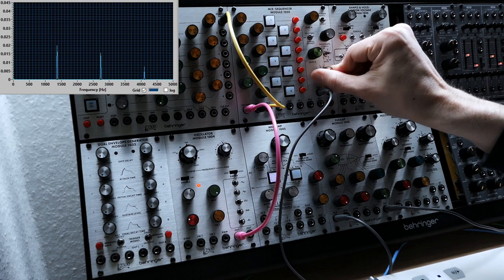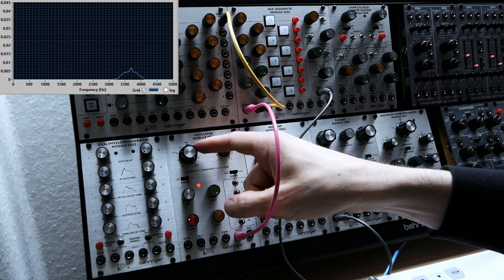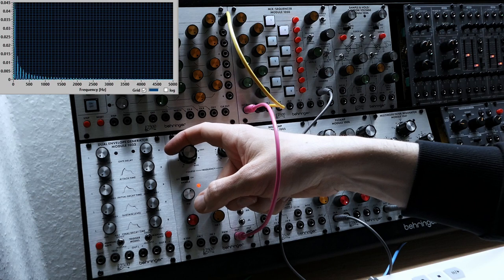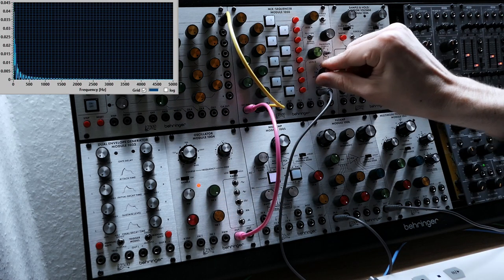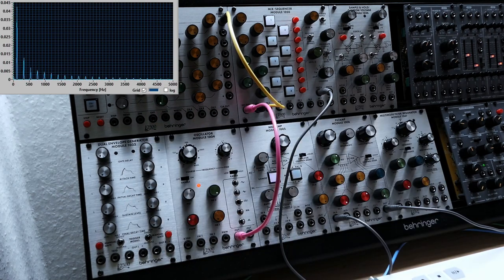And this makes it a perfect sub-oscillator in this mode. Just feed a constant CV into one or more of the inputs, connect the external advance input to a VCO output, and have a nice subharmonic oscillator added to your mix.